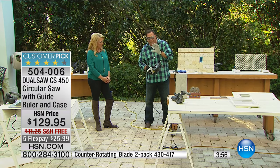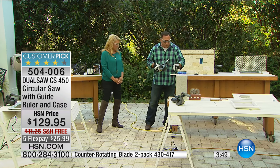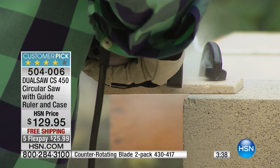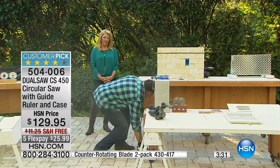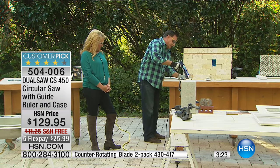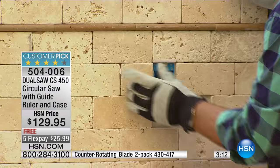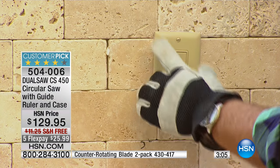We've got some diamond blades mounted in this right now, and you can buy those as well. That's for cutting things like cement, tile, bricks, travertine. I'm going to show you right here — a quick cut, and we're going to do a little backsplash. So we got our little piece we cut off right there. We're going to come back up here. We're going to put a little adhesive on the back of this guy just like this, and a little bit on the other piece. I'm going to give you a new backsplash in about two seconds. There's a piece I just cut — fits in perfectly. Here's a piece I cut earlier, going to put that right there, and then we put in the light switch on the backsplash. Voila!